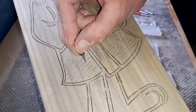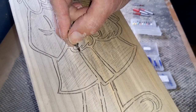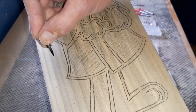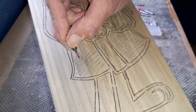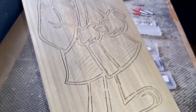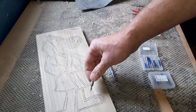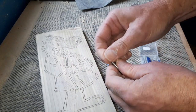That way when we come to clear both sides of this, that should basically still be the same thickness in between. So just bear that in mind. If we're removing the outside areas, outset, we route up to there. Removing the inside, we route up to there, never on the line itself. You'll find your own little technique as you go along. So once we've gone around all the lines with our CNC bit, we'll remove that.